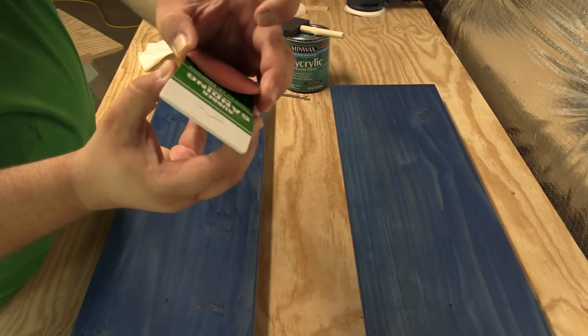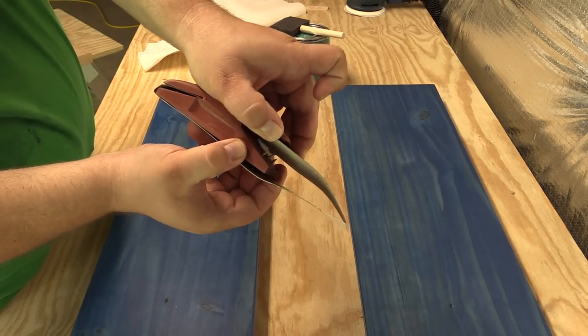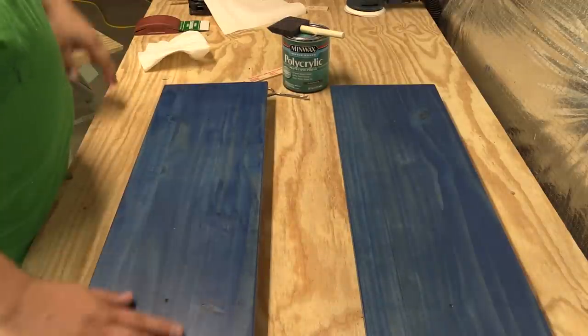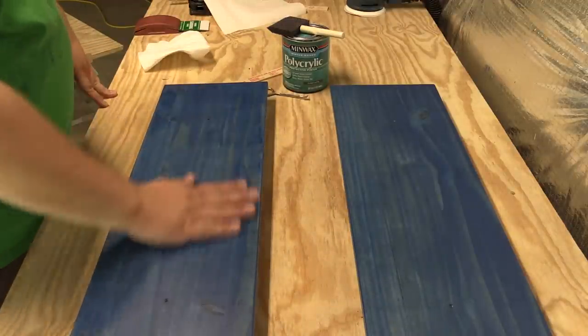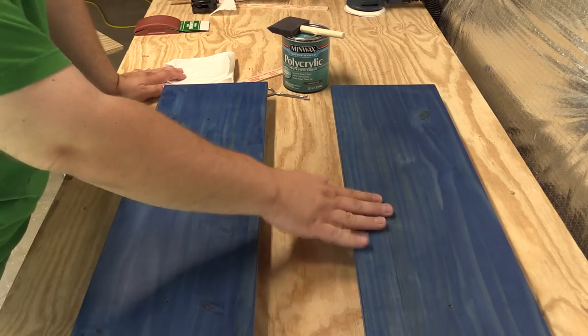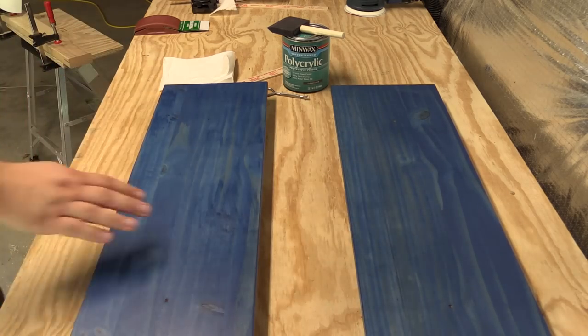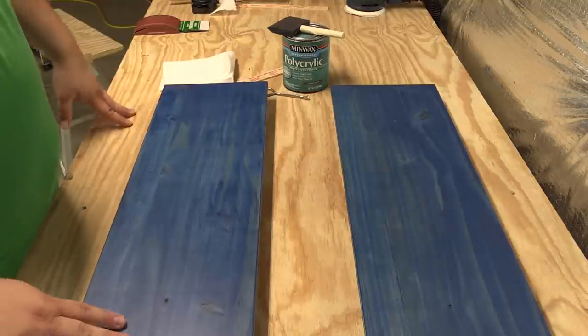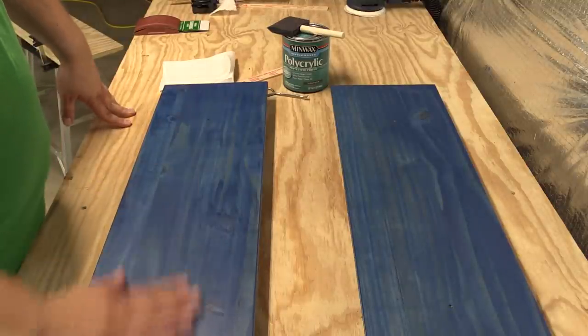You basically just open it up — there are some metal spikes in there and you put your sanding paper on. The clear coat will basically fill in the valleys, and we'll be sanding the peaks down to meet those valleys, slowly building up a coat. These still feel relatively smooth. There are a few rough spots, but not worth sanding at this time since I'm going to end up sanding the finish down anyway.